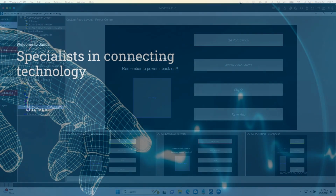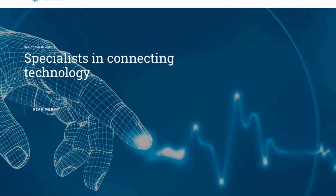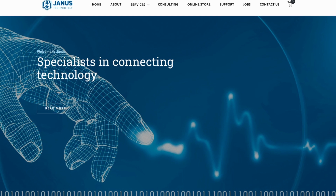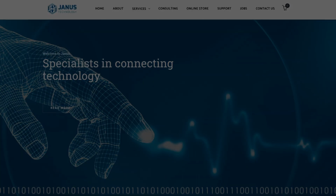So we put in a request to JNS Technology to develop a two-way IP driver for IP PDUs, and they sent it over to try it out. So also here on my test bench is the Aten PE4104G. So it's got the same integration rules. You need to log into the web UI and enable Telnet.